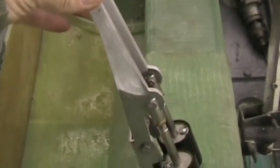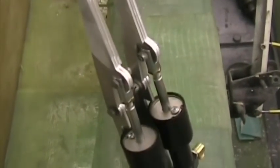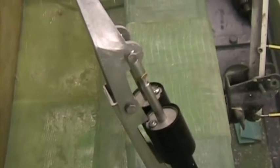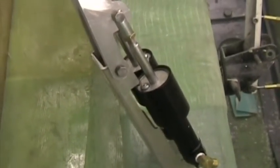Here I've finished assembling the master cylinder assembly. They're the two Grove master cylinders and the laser cut aluminium mountings as detailed in the plans. Now, because this is a nose wheel Whisper, there isn't a bulkhead to mount the brake master cylinders on, so I've had to manufacture this plywood piece to mount the cylinders on. They're going to mount like that.